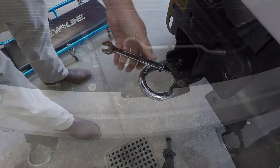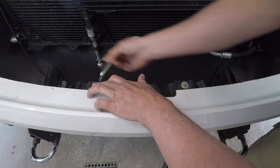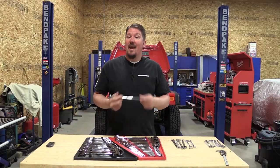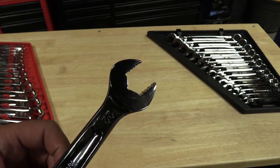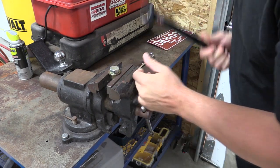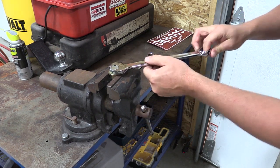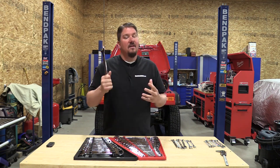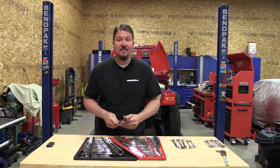Using these, they felt comfortable in your hands, and if you're used to the normal Milwaukee combination wrench you'll really like them. They have a nice chrome finish that cleans up well. The max bite area is something I've had to get used to — the grip you get on a bolt is immense. When pulling on the bolt it can actually hold the bolt or nut, making it hard to slide the wrench off. But that same feature stops you from sliding off and ripping your knuckles. I still have some smooth wrenches for small fast jobs, but I've learned to like the max bite.